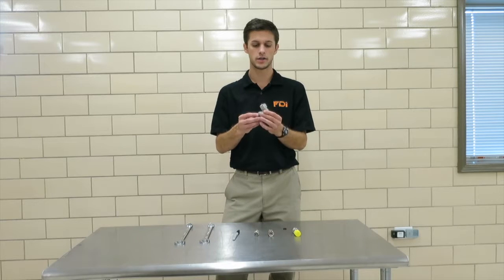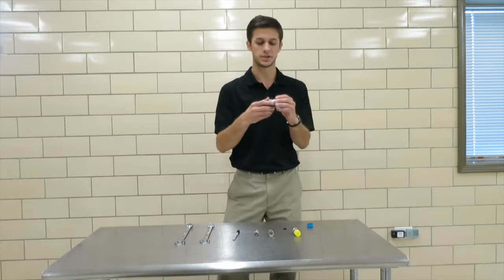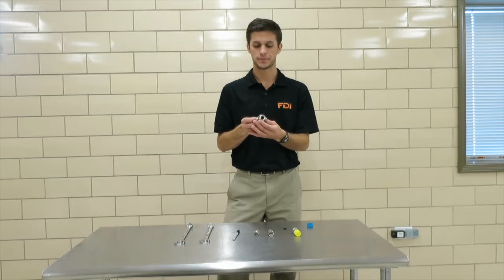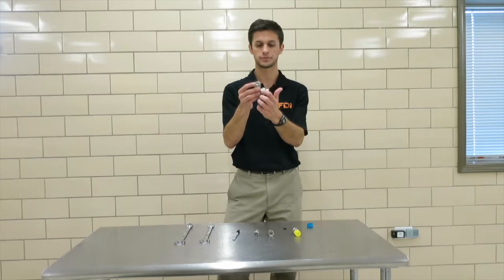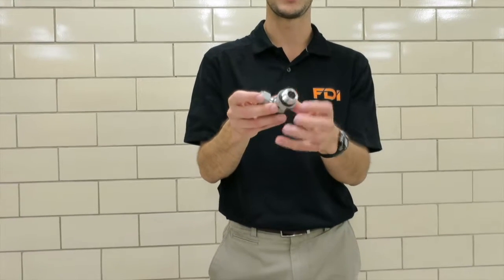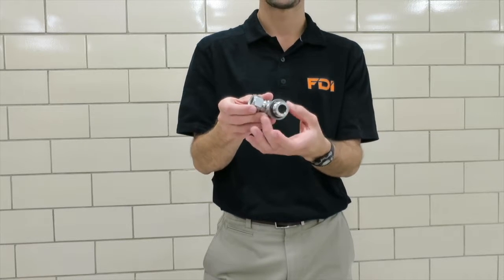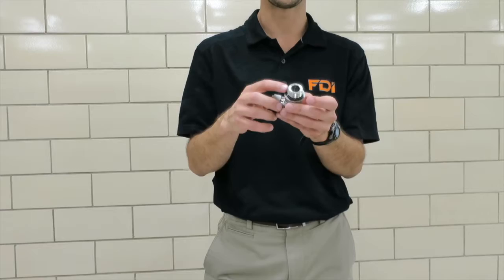First, this is called a straight-thread O-ring seal. This is a positionable fitting. There are two of these on the P2131 — they're down in the water recovery system on the heat exchanger. It's a 90-degree fitting installed onto the heat exchanger. This flat washer and this nut allow it to be positioned and then tightened. You'll see that O-ring there — that's what seals it off. It's that O-ring boss seal that seals into the heat exchanger, and then this nut tightens it. So that is the straight-thread O-ring seal.